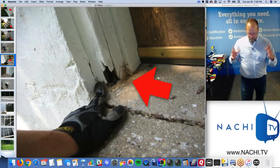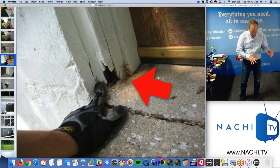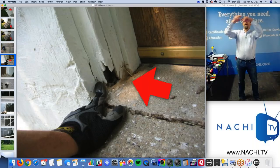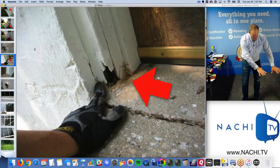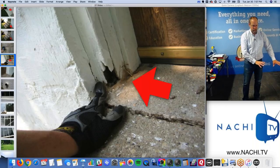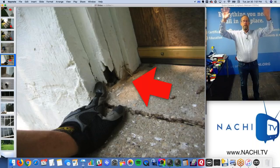Wood rot. So at every door or every window, I do the same thing. I go counterclockwise, right? So at this door, bottom left, bottom right, top left. And I'm looking for wood rot down here, or tread problems or stoop problems or step problems or weather stripping problems. And on the top, it's really just header flashing or settlement.